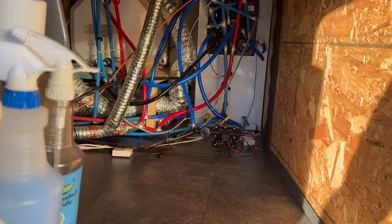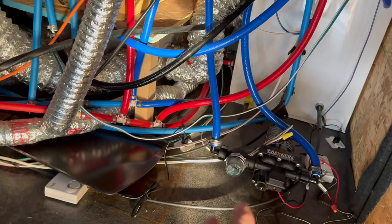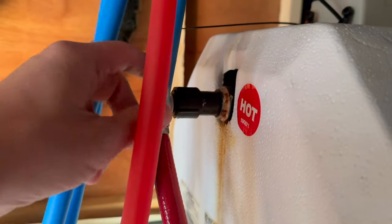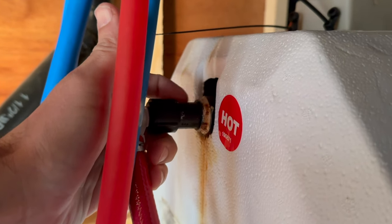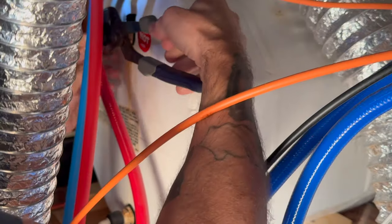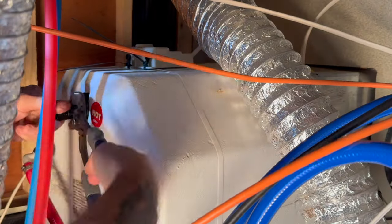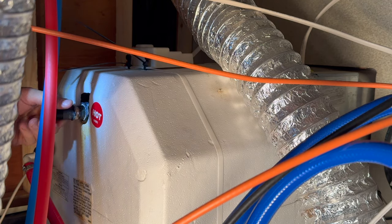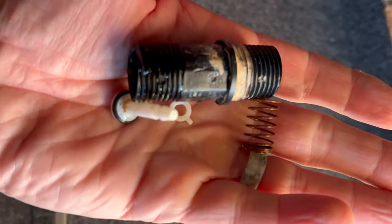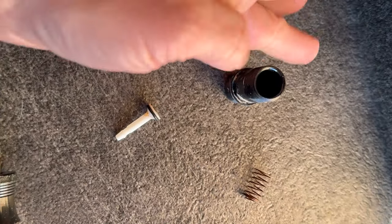We've got the basement door open — I like to keep that door on a hinge because we need to get back here often to access things like water pumps, possible leaks, and who knows what's causing us issues. Today we're going to be replacing this old plastic check valve in here that we're assuming is the problem. We're basically just going to be unscrewing this water line and taking that off. There's the old check valve — it almost seems broken. It pushed in really easy. As soon as I took it out, those parts just fell right out of it, and they're not supposed to do that. So it was definitely broken.